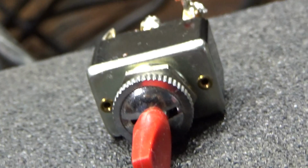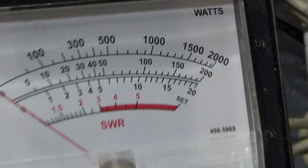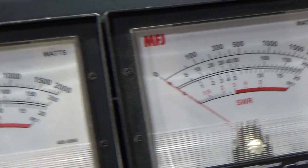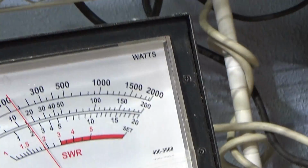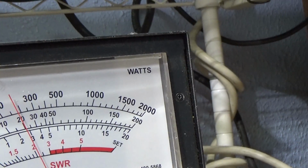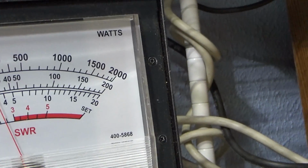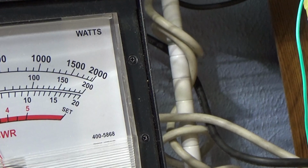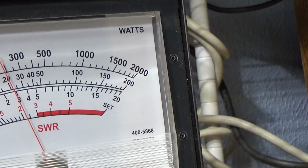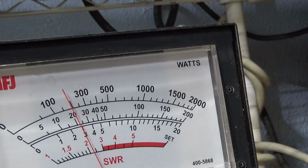So you're gonna put it on operate, and we're just gonna go to the high side and put that on a 2,000 watt scale on average. Again, only putting 1.5 watts going into this thing. And we're dead keying 150. Well, it creeps up because it's got that voltage doubler in it, and it takes it a second to charge the cap. Audio, we're up to about 200. Audio, barely swinging forward on average, but again, remember what that radio is doing. 1 in, 200 out is not bad.